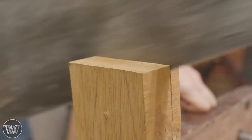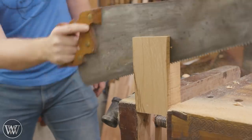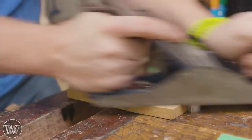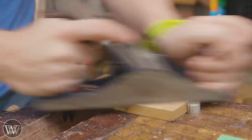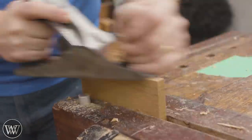This is actually starting to pinch on the blade so adding a little bit of hard wax to it will make it run a lot smoother. Cut about halfway down from one side, then come back from the other side and make the two lines match up until we have a chunk of wood. Now that we have that done, we can flatten the other side.